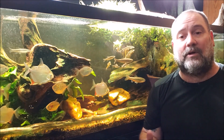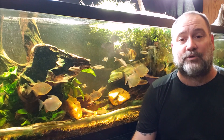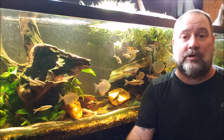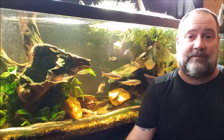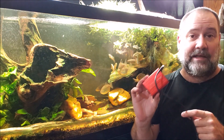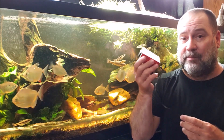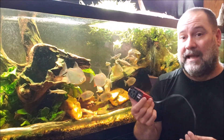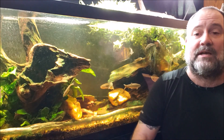Let me point out that this 1100-watt power inverter is pretty big — that's a lot of power to invert and it would drain your battery quickly if you're actually drawing that much. I tested my Tetra Whisper hang-on-back filter for a 10-gallon tank on my kilowatt meter and it's only drawing four watts. So five or six of those little filters running would mean a simple 150-watt inverter is plenty. Keep in mind if you're running heaters — a small heater runs about 150 watts — that will max out a small inverter. If you're simply running the filter and maybe an LED, a battery can probably last many days.